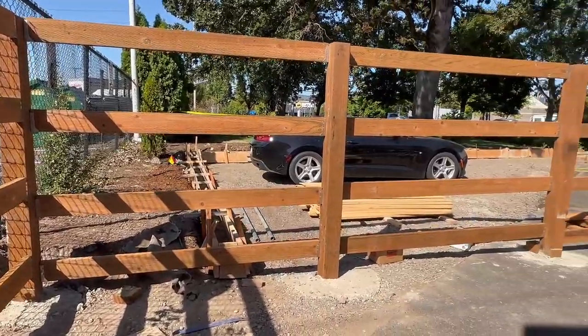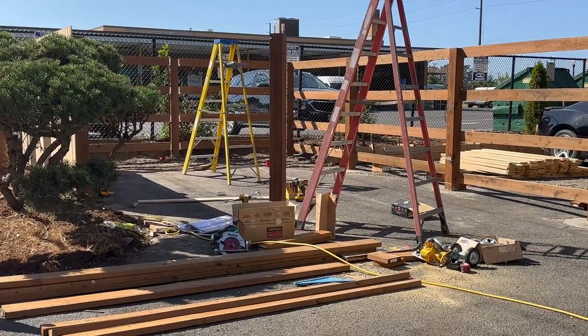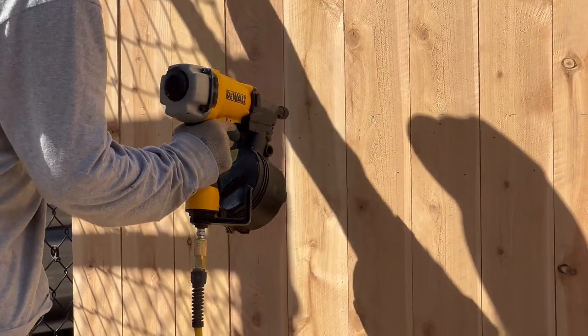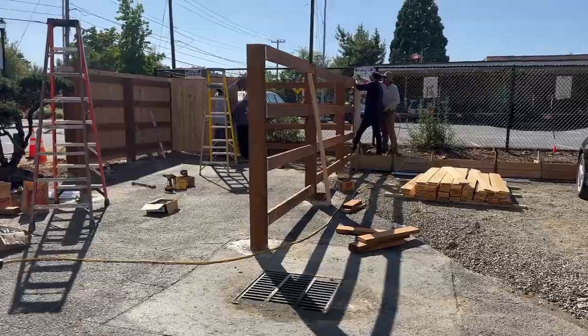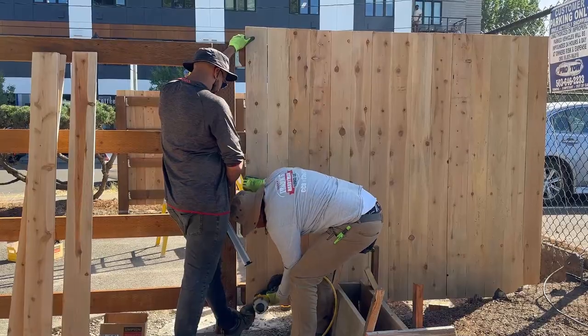On the back we're going to put the fence panel on the inside, but everywhere else the fence panels go on the outside for a nice clean look. At the very end we're going to stain everything so this material will last a very long time. That's pretty much the process of how you can assemble the rails and the fence panels.